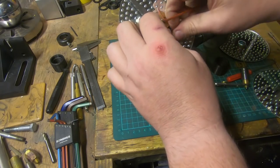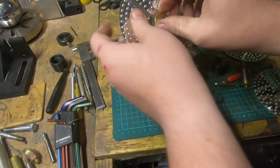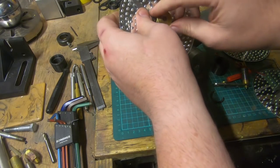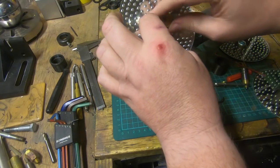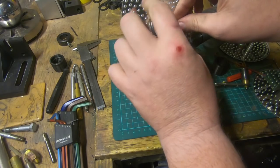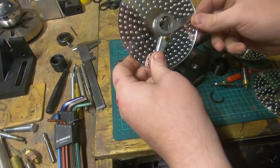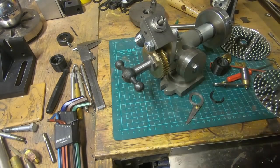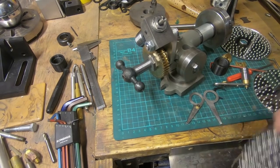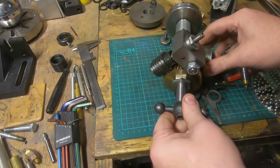I've got a bit more backlash in this gear shaft than I'd really like, so we're going to fix that while we're shooting this video. The little screw needs a slightly different end on it — a little bit too much radius — and the notch it runs in isn't really retaining the shaft in the right place. The new plates are a little bit thinner than originally expected, so we've had to modify a few things and we're seeing some backlash.